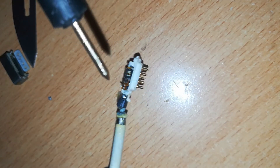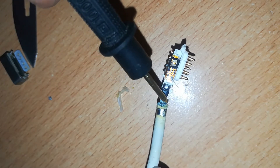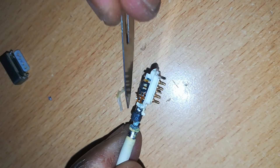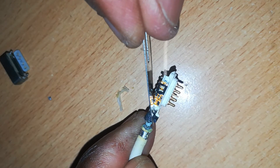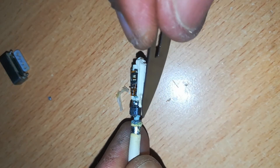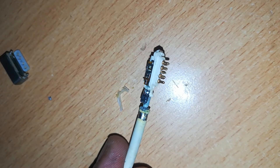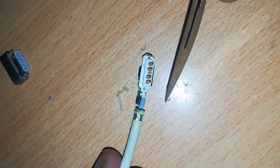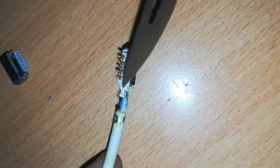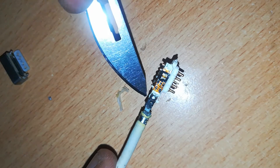But the negative side has a break in the wire — that's the cause of our malfunction. Remove the black insulation which covers the point of contact; you can cut it off with a razor blade. This will further expose our defective negative wire, or V return, which does not have continuity at that point.